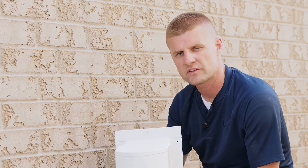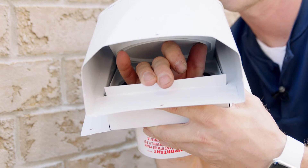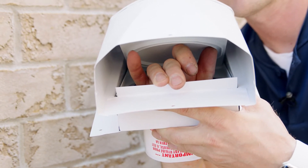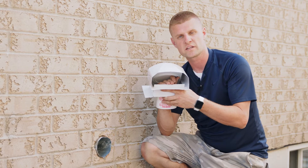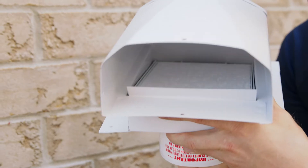The AF4C has an anti-gust flange on the bottom of the vent. This prevents critters from getting in and opening the door to get into the home. The anti-gust flange also prevents the damper from opening and closing, creating that annoying clanging sound that traditional wall vents have.